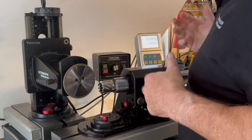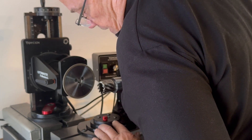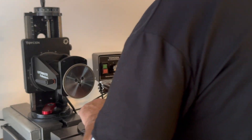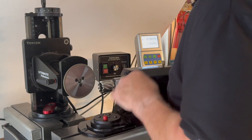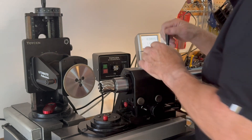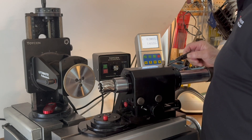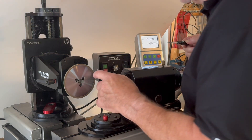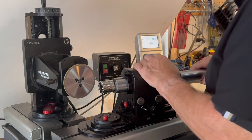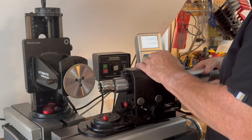All you're trying to do is figure out what it takes to match the existing grinds. In this case we are at zero. We're going to set this at about 10 degrees, just so we have a little bit of clearance, and give that a snug. We have the 510 indexing collar engaged. We're using the single numeral five for the single beveled teeth. When you go to the slot that says 510 — two numerals — it's going to have two grinds on it. That's just so we can keep track of it.